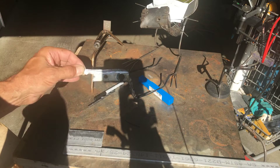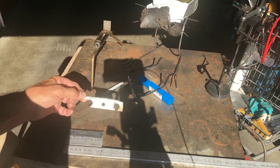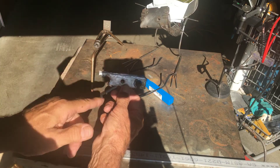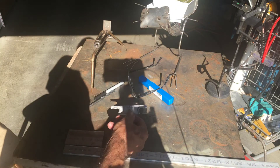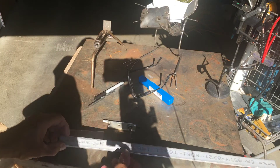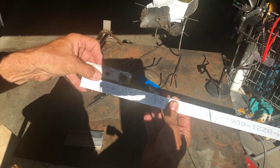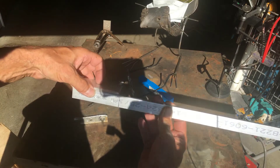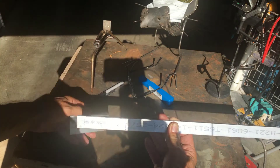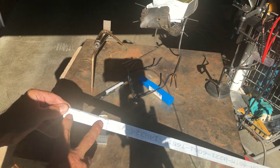This was welded onto a big L-bracket on the bottom of the cart, and I decided to just grind that off. You can see what happened — this side was bent over and broken, so it was only using one side. This hole here is for the return spring. So what I'm going to do is use this piece, weld this bracket onto it, and then just bolt it to the existing piece I left behind. I'm going to take this down and drill these out.